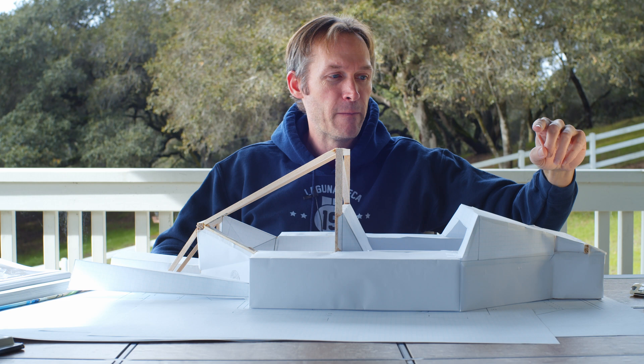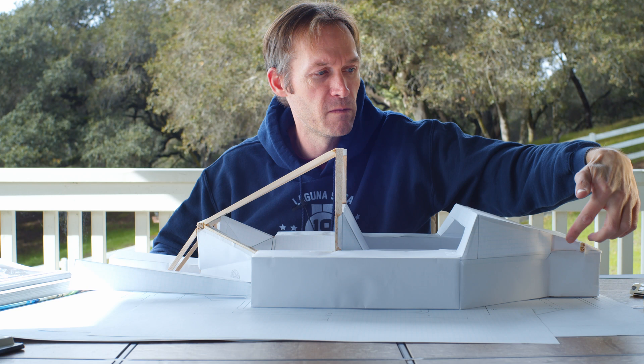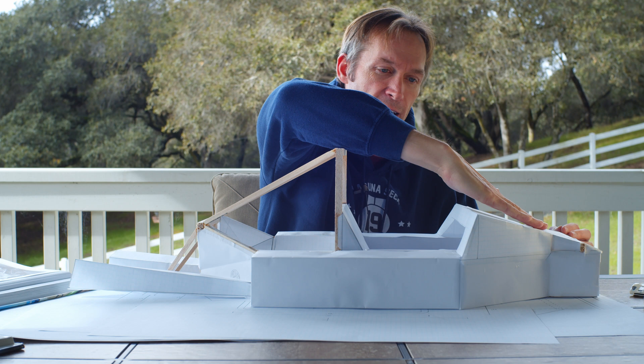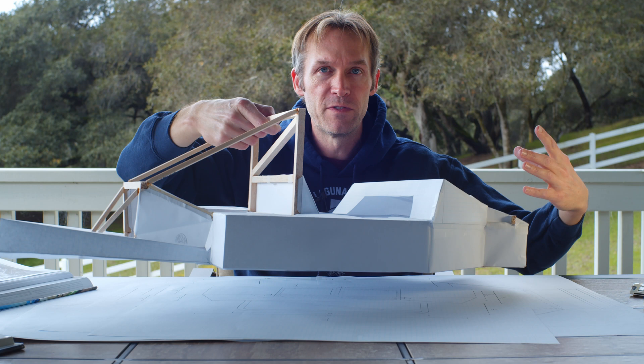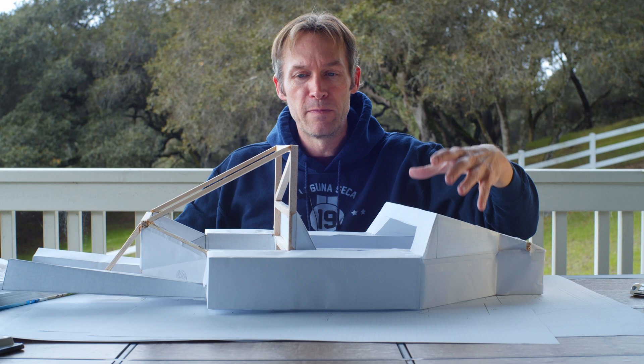This structure is nice for stiffness but it's really just trying to make it safer. If I really wanted maximum safety there should be something overhead. What I did is hide another structure in here — round tube going through that welds to the steel up front. With the broomstick test, having it there is actually better than if something were at the full height. If I want to make it really safer — I think about my son potentially driving this someday — I could put brackets here that come up a little bit with cross tubes, adding both safety and some rigidity.